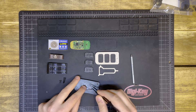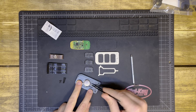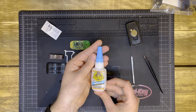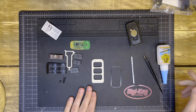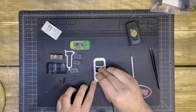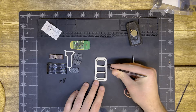So now that you fully understand the design, I'll show you how it actually goes together in person, starting with the back plate. First things first, we'll take that battery holster and drop it in over the pin. Then we'll take our CR2032 battery, aligning the plus signs, and just drop it in there. You'll see this little hole so you can easily pull it out if you need to. Moving on to the front plate - this is the detail ring. It basically just slips on totally for cosmetic reasons. So we'll use a little bit of super glue and the end of a zip tie here just to spread the glue around - just a nice even bead, nothing too crazy, just enough to hold on the detail ring. It's like a tenth of a millimeter, so there's really hardly anything there.